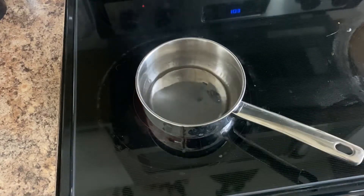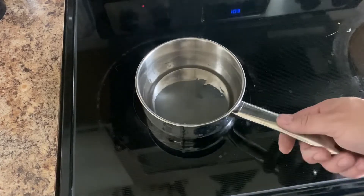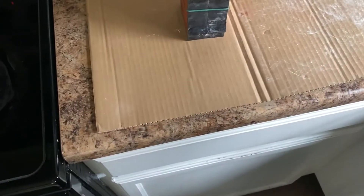What I'm doing right now is I'm moving it around to make sure it's not still crystallizing. If you look really close at the metal and move it, you can see what looks like snowflakes forming in the metal if it's too cool. So I'm heating it up to about the smoke temperature of peanut oil, which is about 450 degrees Fahrenheit.